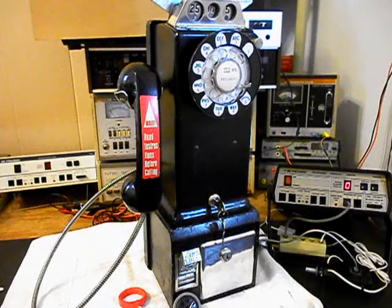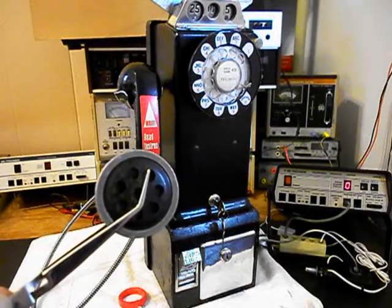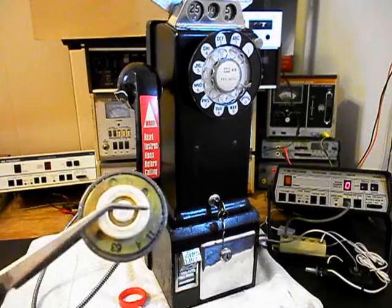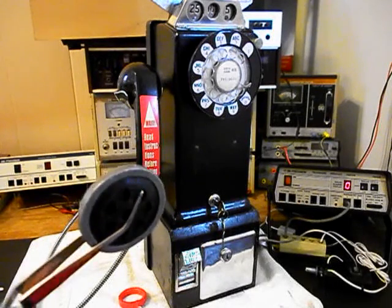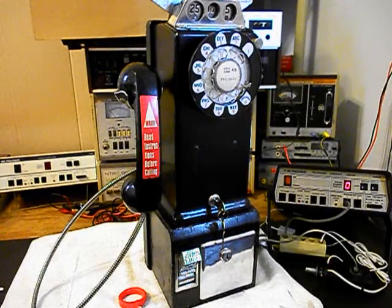We also want to talk about the receiver. On a payphone, the receiver cap and the transmitter cap are epoxied on, so we made sure they were broken free. This handset has the older style T1 transmitter in it, and they can become noisy — they crackle, sizzle, and pop a little bit. The one that's in it is in pretty good condition, but we wanted to make sure it could be replaced in the future if necessary. The same with the receiver capsule — the caps are loose and can be taken off, and the components can be changed if need be.